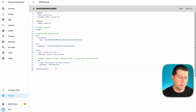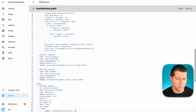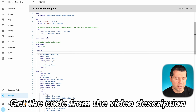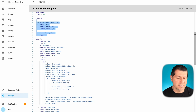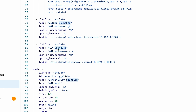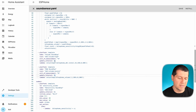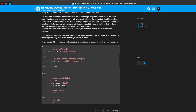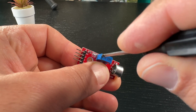I'll click the edit button, go to the last row, and paste in the configuration code. This code will enable the web server of this device on port 80 and will add a few variables. It will also add three sensors: the dB sound sensor, the volume sound ESP sensor, and the raw sound ESP sensor, as well as one sensitivity slider. You can change the update interval — for example to one second or five seconds. All credits for the ESPHome code go to Brenner Ruberth from the Home Assistant community, who figured out how to extract the dB sound, raw sound, and volume sound from the KY-037, as well as a digital sensitivity slider to use instead of the physical knob on the device.